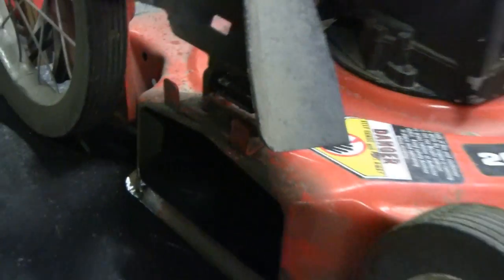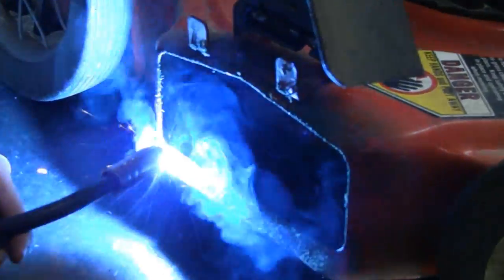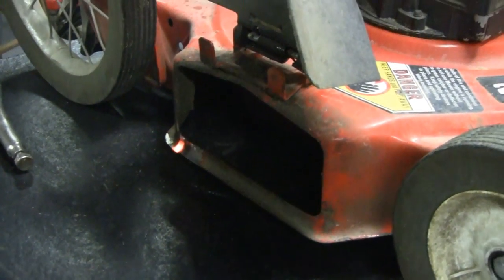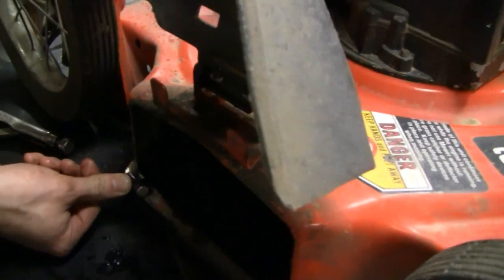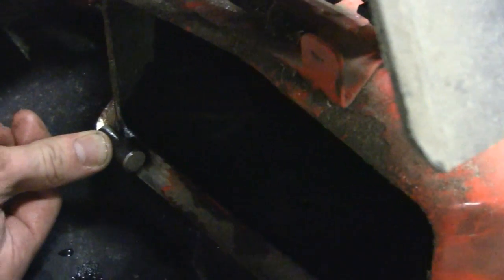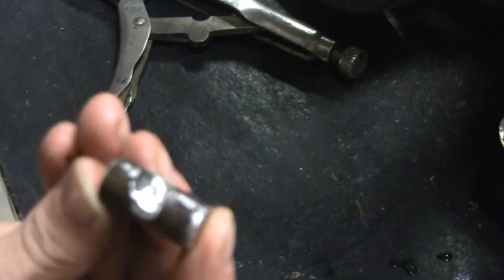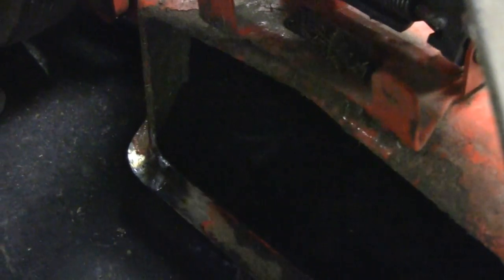I'll go to the top one. Get it hot enough? I think so. Cherry red. That's probably a hold but we've got stuff to reinforce with — might as well. Little racer got himself a piece of reinforcing rod. He don't need much. He cut a little notch out there to go around his weld so he wouldn't have to grind it out. That's pretty clever.